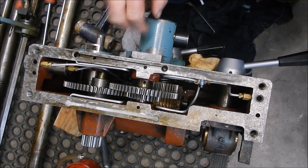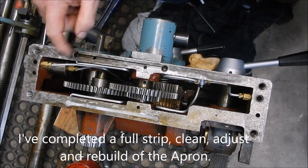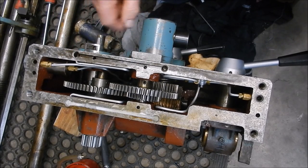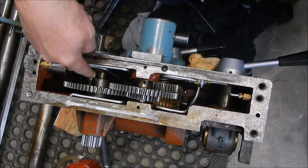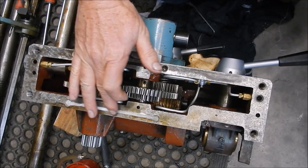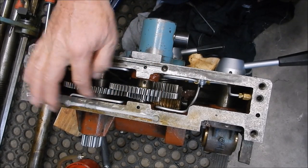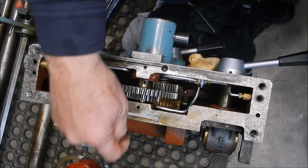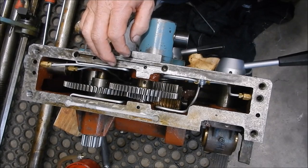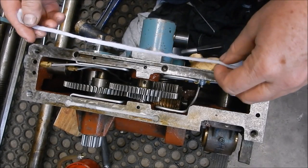Alright guys, this is the top of the apron. We have an oil feed coming into this point just here, and we have two oiling points further on down that oil shafts in line with those holes. You can see I've put my felt in on here — this only had one oiling point. It's got a second oiling point that is fed from the back end of the saddle. We've got these two oiling points here and I've made up my little felt wick.